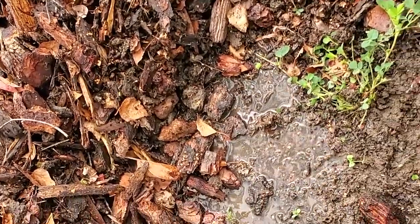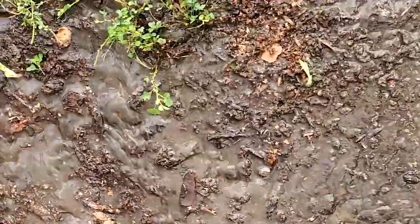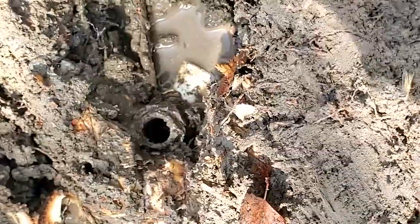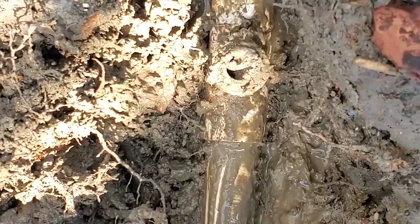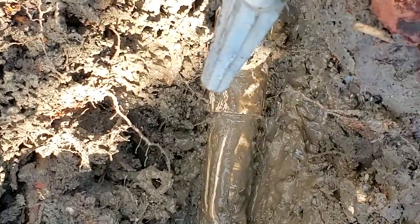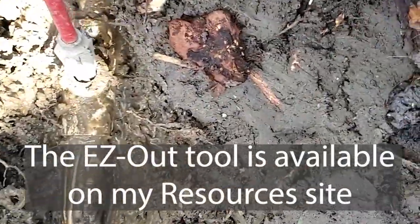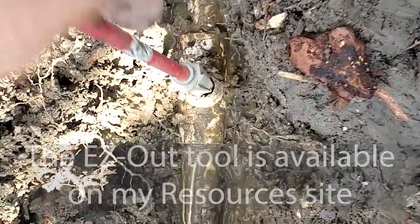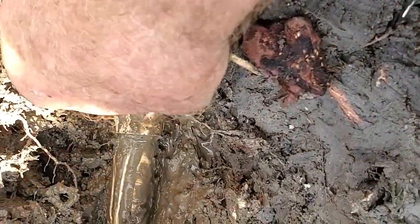While this was running I saw water pouring out from the bark near this pop-up and pulled the bark back. I could see that it may be a broken pipe or riser, so I dug up the pop-up and cut through some tree roots from the neighboring birch tree. The roots had busted the riser. So we put the tool in there at an angle and spin that puppy out.